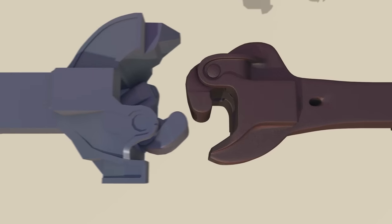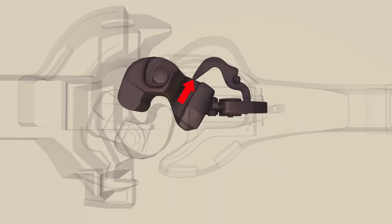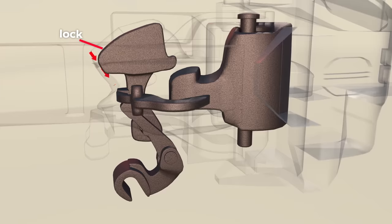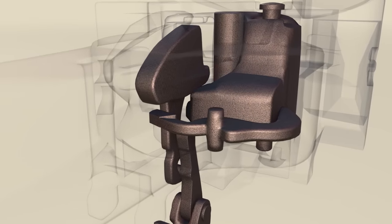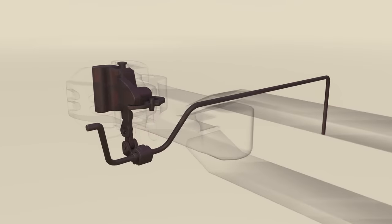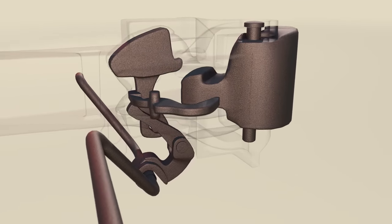Or one closed and one open. As knuckles make contact, their rounded shape causes rotation that presses against the knuckle thrower, which in turn moves the lock. The lock rides along an internal channel and also rests on a sloped feature at the back of the knuckle, so that it naturally slides into locking position as all parts reach the end of their travel. For uncoupling, there's a manually operated bar called the pin lifter or cut lever. When rotated, parts operate in reverse sequence to coupling — the lock rides upwards, pressing the knuckle thrower which rotates the knuckle into open position.